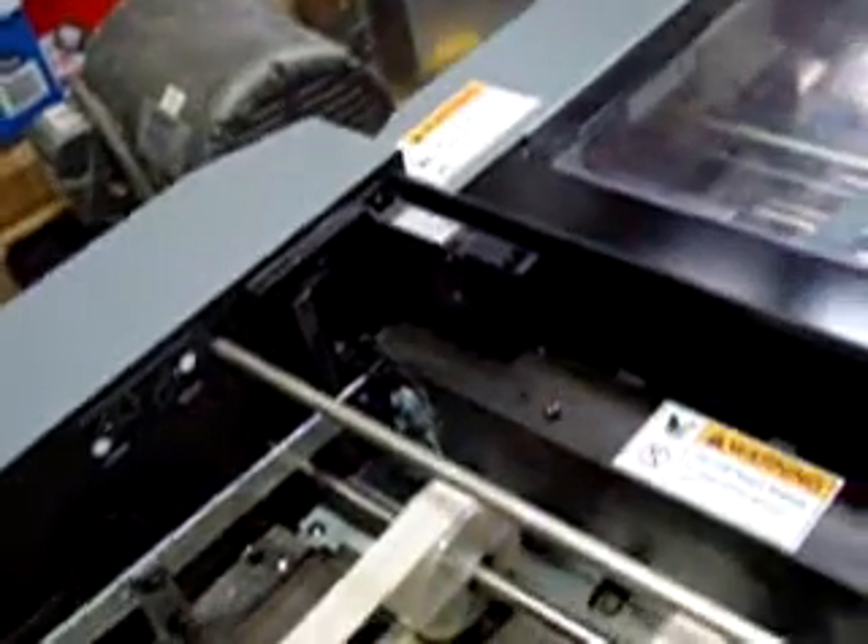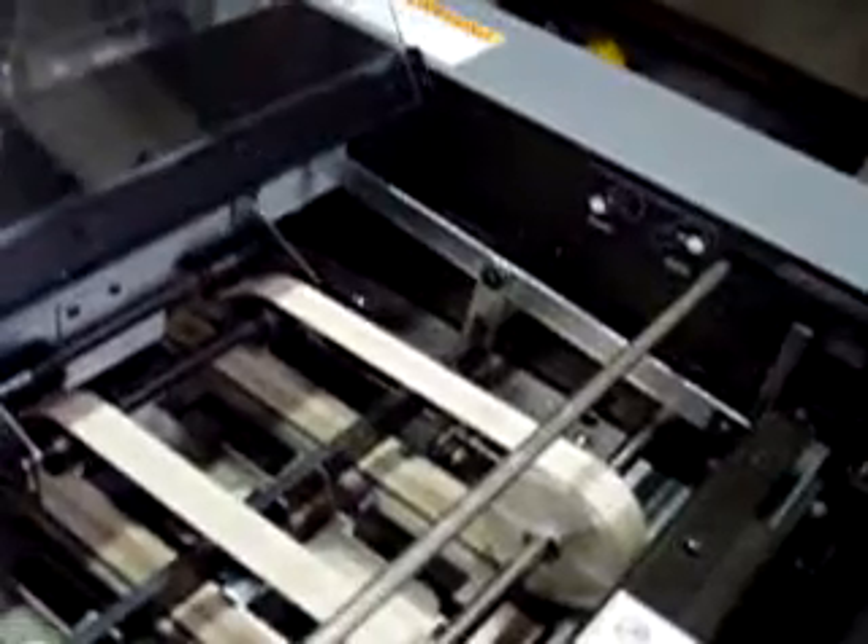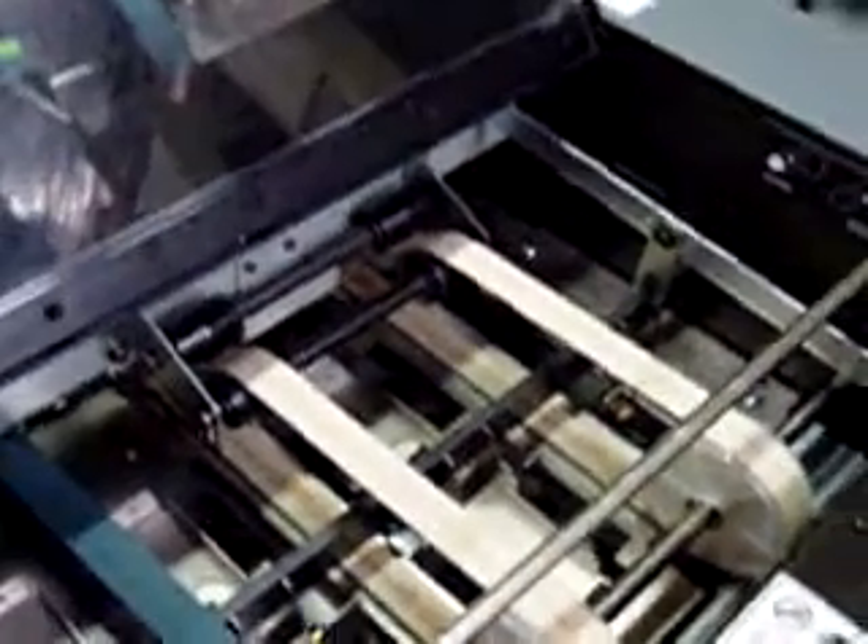You need to have somebody who knows what they're doing with a trimmer. If you've ever set trimmer blades before, you're okay here. The only thing you want to take care of is to make sure you see the little white guides right here — a little touch of grease probably once every six months or so. If you're running it every day, do it once every three months; twice a week, once every six months; if it sits for weeks without being run, once a year. Keep everything clean — just keep all the debris and paper scraps out. A vacuum cleaner's going to help you. Unplug it, vacuum out all the garbage, wipe it all off, and it's going to work out perfectly.